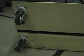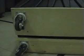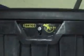Okay, the bin costs about 50 bucks, and then what I did on the bottom of it, you can see, is I attached some wood. I Gorilla Glued it, let the wood dry. I put another piece of wood on the inside, Gorilla Glued it, let it dry, and then zipped through and put locking casters on the bottom. This thing cost me $100 to build, and I would have no problems whatsoever stacking those up.